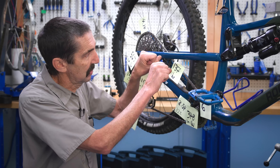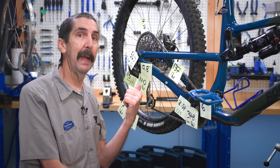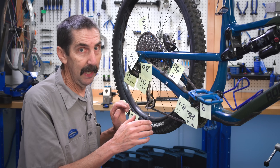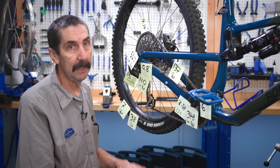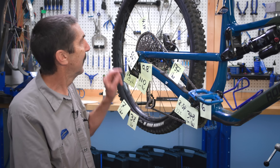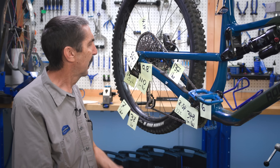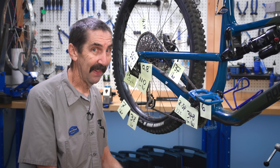Not inch pounds — this is not torque. This is just pull on the chain: 137 pounds. And what's it pulling? The wrench back here — that's the big 52-tooth easy gear. I don't want the 52 teeth; I need that radius. Using the 2πr formula, it is a 4.14-inch lever — that wrench length. We're generating 567 inch-pounds torque at the hub. That's like a really tight crank bolt.